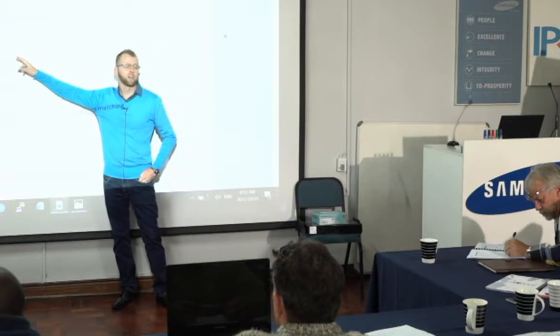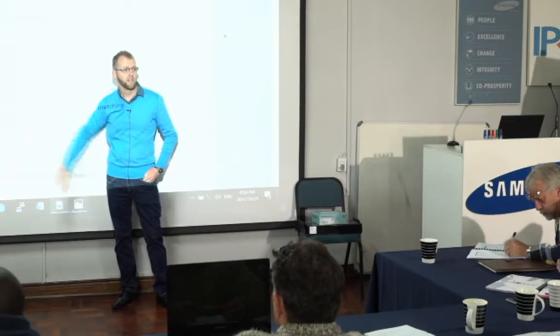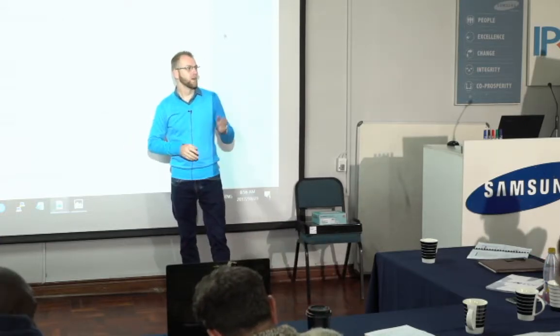If it says minus, for argument's sake, minus 27, the signal is too good for the router. It doesn't make sense, but it's too good. So you have to turn it away a bit. It must be more than minus 27, basically. I think around 30 or 35 is fine. You can take it between 35, in some cases, depending on how close you are to the tower and so forth, take it on 40 to about 60.